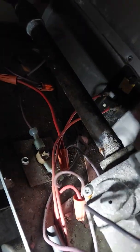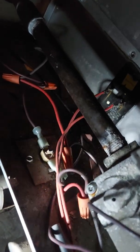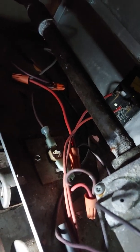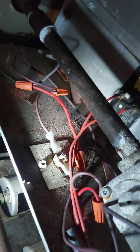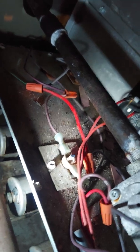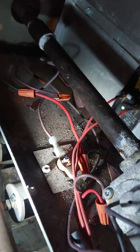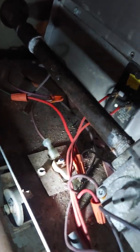I checked the blower motor and it was spinning freely, and previously it was working fine, so I didn't really think it was the blower. You've got more than one direction to go with this, but it turned out to be a simple fix — just press the reset, put the door back on, let it go through its cycle, and the blower came on. The flame is staying on. I'm happy. The house is going to stay warm.